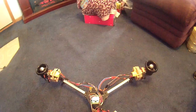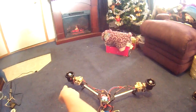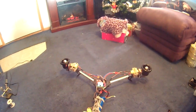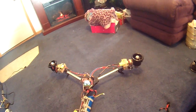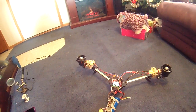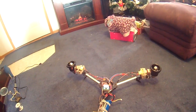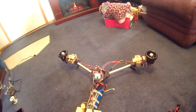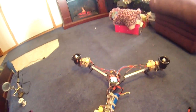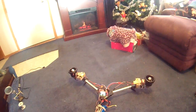The biggest issue besides the arming issue is one of the motors will cut out when the voltage gets too high — that's why that side lifted up, because that side stopped working. I had a different battery on here earlier and the thing actually lifted off the ground about an inch or so, and I was able to do a little bit of controlling. But I'm still trying to figure out why these two motors are hunting back and forth as far as the rudder is concerned.